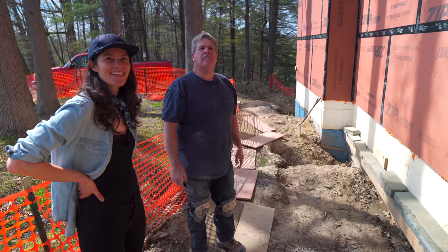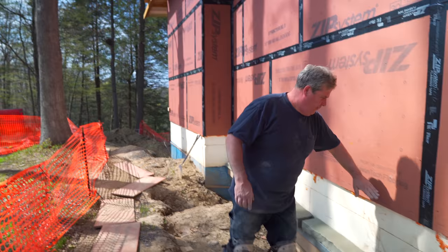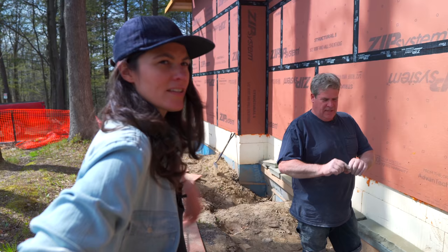Are you afraid at some point that the wall is going to fall? It's all tied in with metal wall ties. What I do is I screw into wherever there's a stud and put massive wall ties. When I lay the stone, you just flip them down onto the stone — they catch on top of the stone in the mud and hold everything together. So it's basically an anchor that comes out in between the stones in the mortar joint.